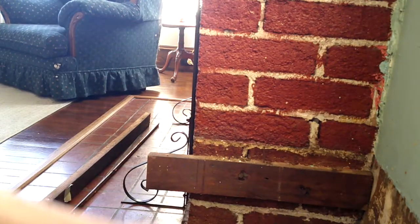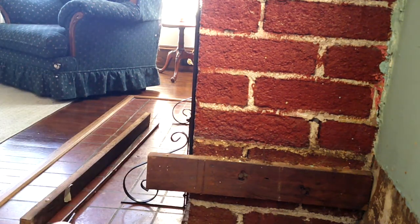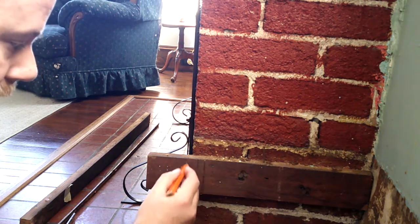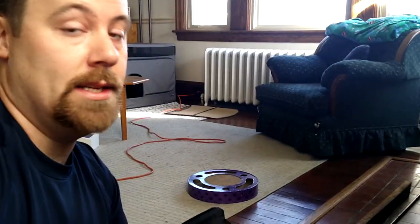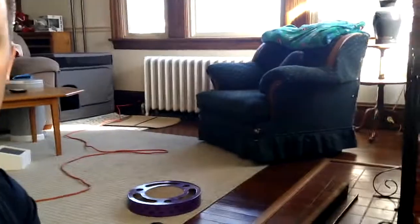What I did is mark a line an inch back from the cabinet, used my square, and struck a line down. This is a tip my dad taught me: whatever side you do NOT want — the side you're going to cut off — mark it with a big X, and make it really big so you know what side of the line to cut on. I'll be honest, I have cut on the wrong side a few times and either cut myself way too short and had to start over, or had to get creative. I want to make sure I keep it sorted.